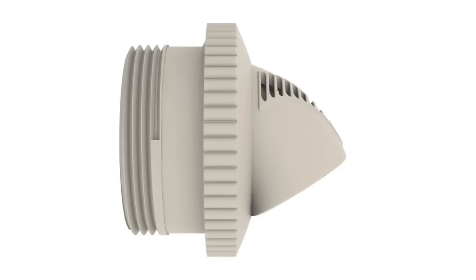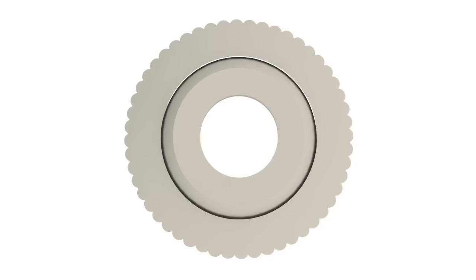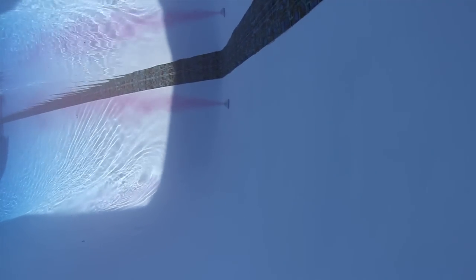V-fittings have no moving parts and simply attach to 1.5-inch threaded wall returns worldwide. Slip fitting adapters are also available. Most swimming pools throughout the industry currently use standard eyeball return line fittings, which typically return water near the surface, creating poorly circulated layers.